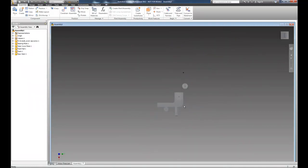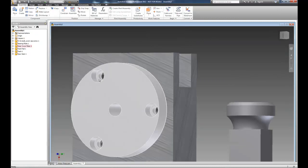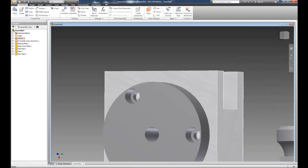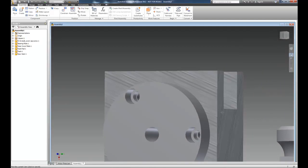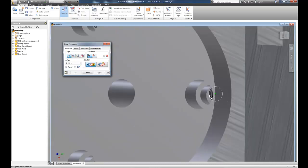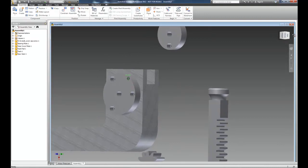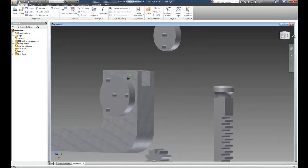How am I going to see to align the holes? I can rotate the view. Are the holes aligned? Yes — if you look inside, I can see threads in one and threads in the other opening too. So aligning the holes is important, and I'll do that through the same center line command. I'll select the center line of the hole and the center line of the plate and align them. It's really important to make sure everything lines up and that we have the appropriate hole positions.